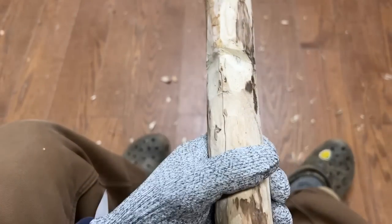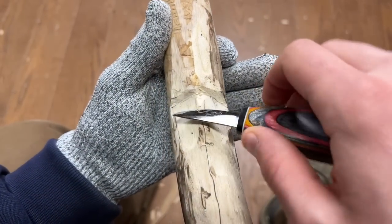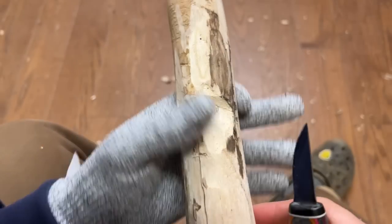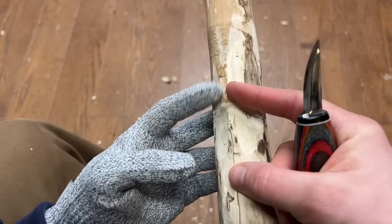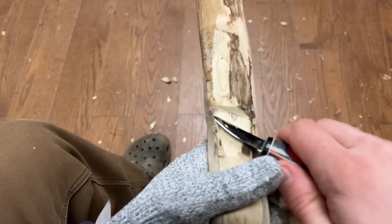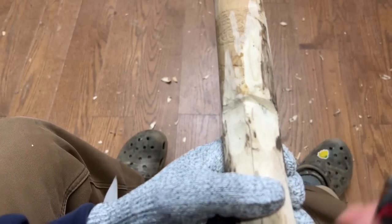Anyhow, as I said, I've just come on either side of this stop cut. Hopefully you can see that. And started to create almost a very soft V. It's like a 140 degree V or something, 130 degree V. I don't know exactly what it is, but it's slightly V'd like that, in other words. So two bars, and I came in on either side here, especially deep on either side here and here.